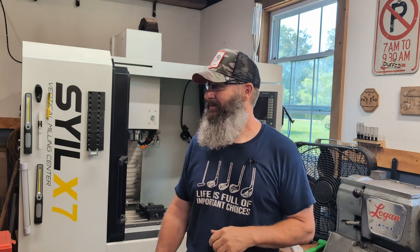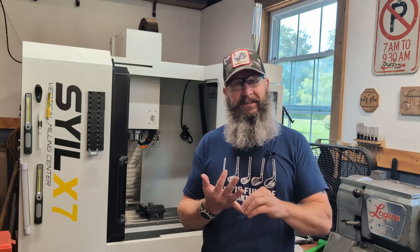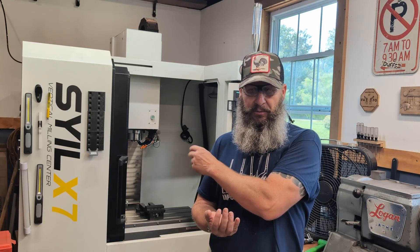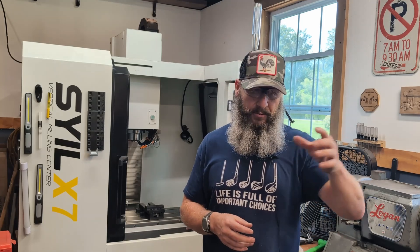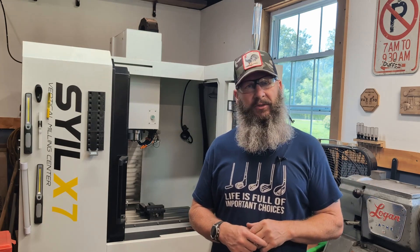Tell me what you think. Next video — it'll probably take another month — is me installing it on the mill and setting my G59. I'm sure there's a tool sold separately that indexes on something like this that you can probe off of to get your G59, but it doesn't have to be exact because I just need to be in the general area so that when my probe comes in and probes G54, it knows where to drive from. Should be interesting — at least one or two videos just on that.